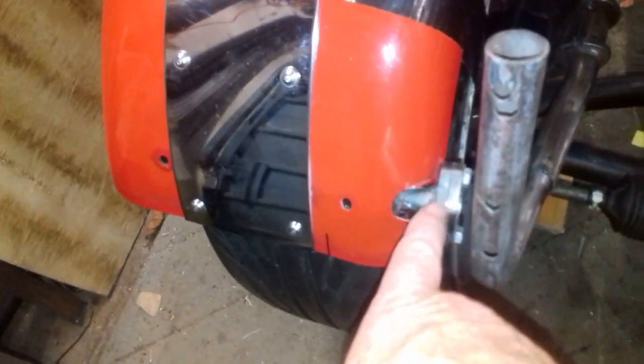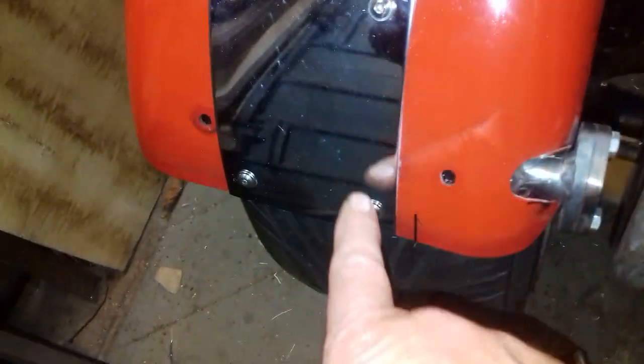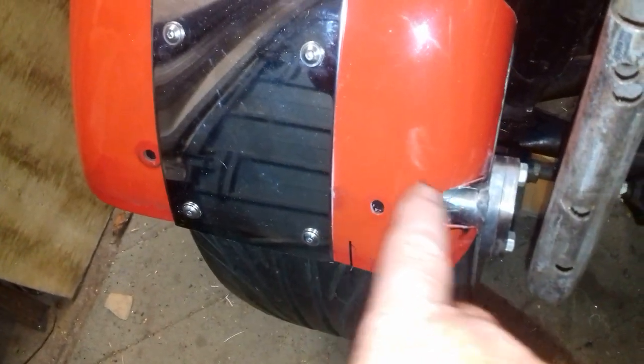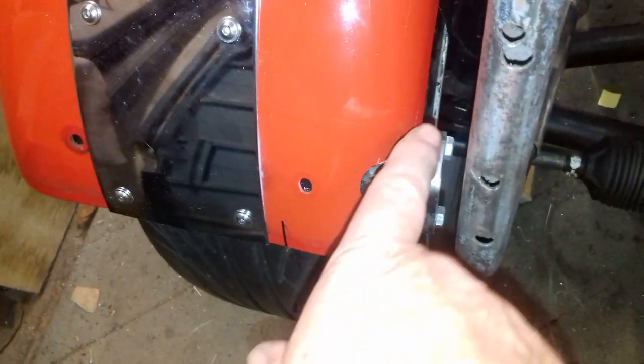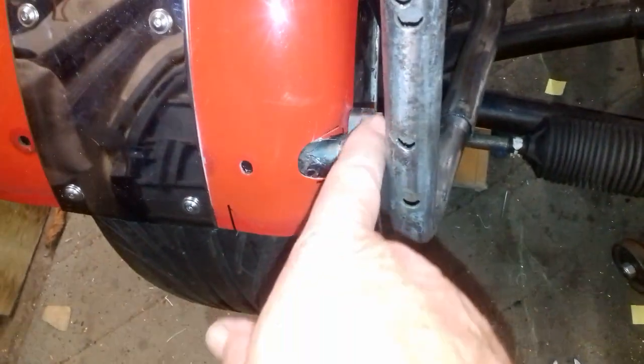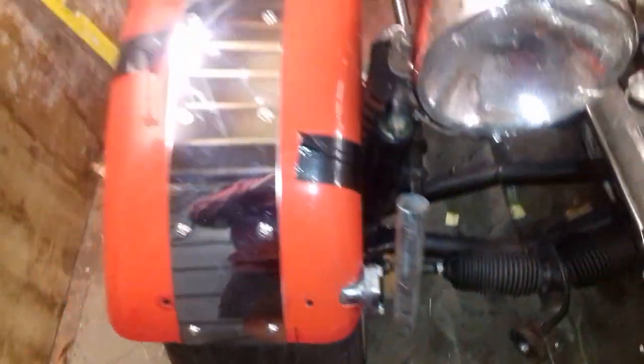So that's the colour sorted. The way the bracket works — this bracket here is a big piece of plate that goes in there, around the back. It's all fiberglassed in and also held in by these four bolts. The tube is welded to the plate and out there there's a pair of flanges. Mine's got one TIG welded on that side, and that one will just unbolt to give me a bit of movement to try and get this bit of tube to fit.